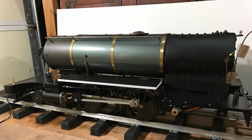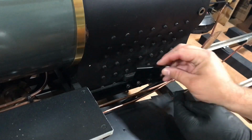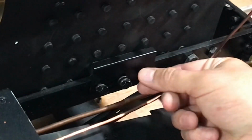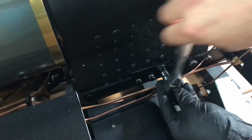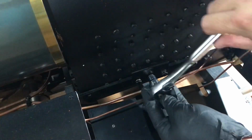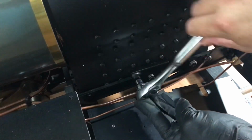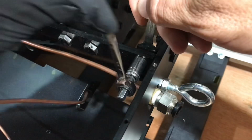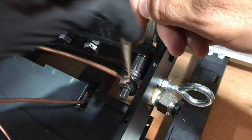After loosening about 1/4 inch on the back half of the frame, the boiler fit in the cradle with ease. This is a boiler stabilizer. They allow the pressure vessel a little excess room while under heat. Here we tighten back up the frame. I loosen the frame roughly about 1/4 inch to let the boiler sit in the cradle comfortably.